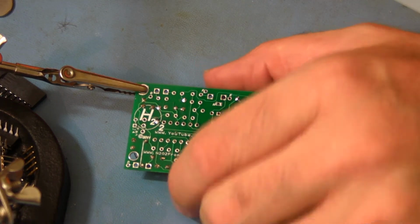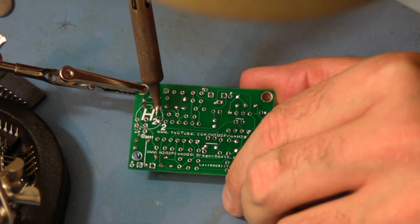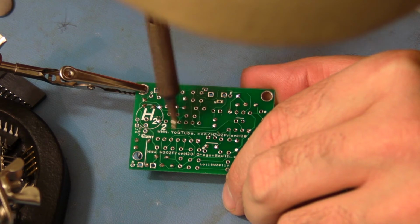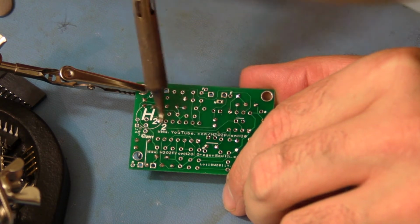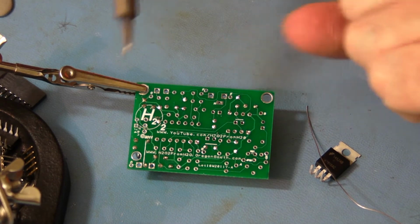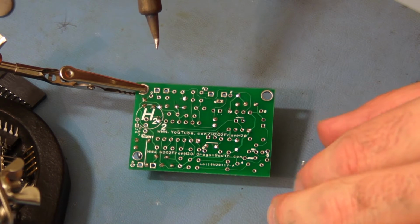your finger on the back side of the board, right on the chip, but make sure you're not touching any of those pins. And you can go back and forth and heat pin 1 and pin 8 really fast between the two, back and forth, and you can walk it and get it flush again to the board. You can do that with any component.